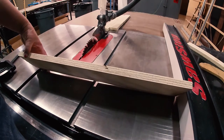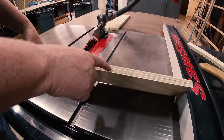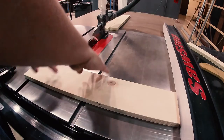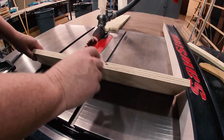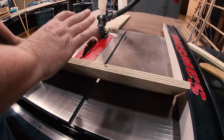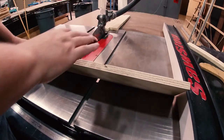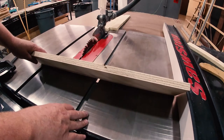Plywood is multiple layers of pine or other material. The grain is alternating — this grain goes this way, the next layer goes this way. The layers are all perpendicular, which gives it its strength. Whereas ripping doesn't really apply to plywood, because the grain is always going to be ripping in one direction and cross-cutting in another.